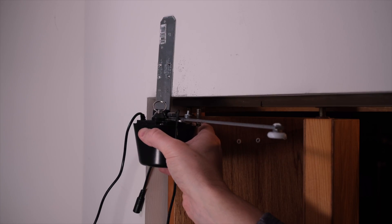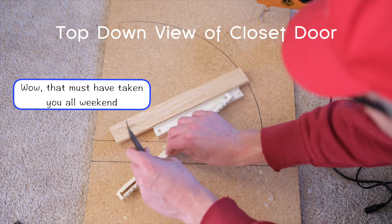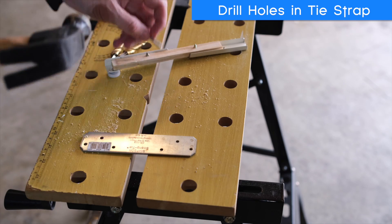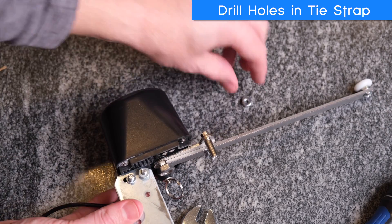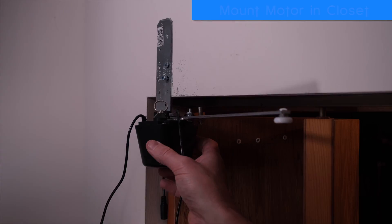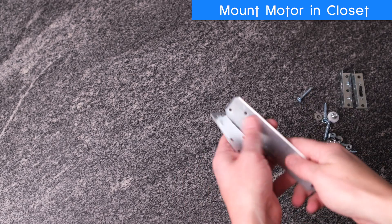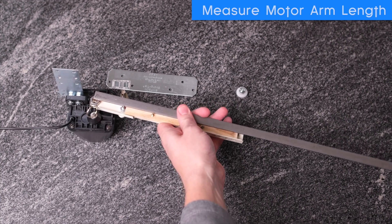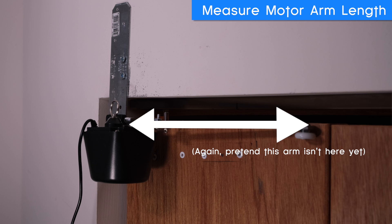You need to mount it so it hangs down below the door frame and the pivot point of the motor should be just inside the inside edges of the door, as you can see in this top-down model I built for testing. As a mount, I used a 12-gauge galvanized heavy strap tie from the decking department of Home Depot, and I drilled some holes into it so I could mount the motor at the bottom with nuts and bolts. Then I drilled a few more holes in the plate to mount it to the studs inside the closet with wood screws. I started with a thinner piece of metal and it had too much flex, so make sure you get the 12-gauge. Next, measure the distance from the pivot point of the motor to where you want the arm to hit the door to push it open — you'll want this as far as possible to give the motor the most leverage.